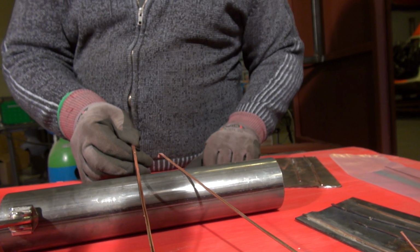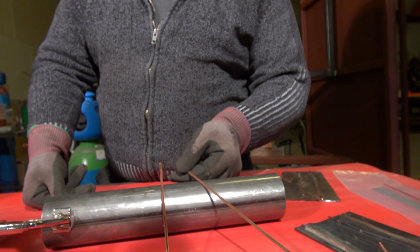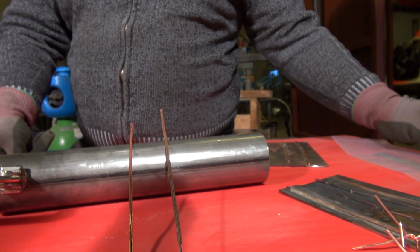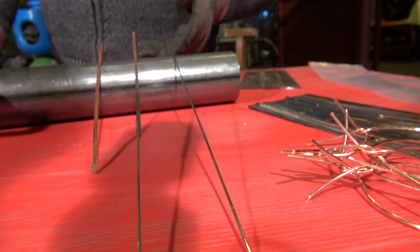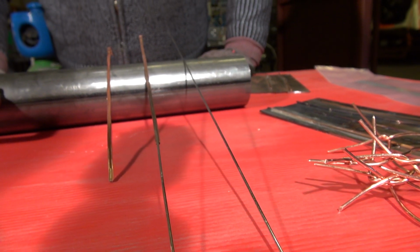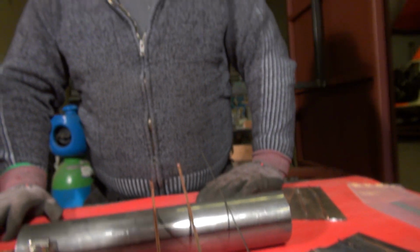Now, we still need to add the soldering material, which is something we commonly refer to as silver solder. It is a high-temperature soldering material which melts at approximately 650 degrees Celsius. It contains approximately 55% silver and 21% copper and a little bit of zinc and tin.